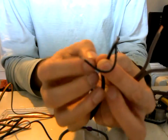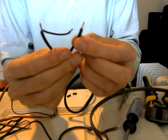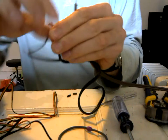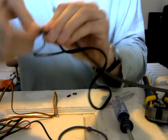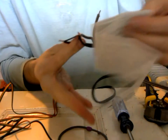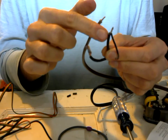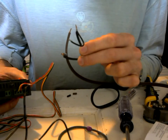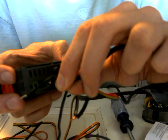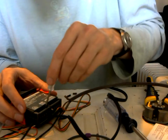So you've got your little bit of wire attached to your power line — this is going to get plugged into the wall. On the other side, you take one end of your humidifier wire and wrap that up there. After checking the wiring directions, the wire with the small jumper bit is going to go into terminal three — just slide it in there, and if you're having a hard time getting it in, you might just need to loosen it a bit more. Slide it into the third terminal and screw it down.